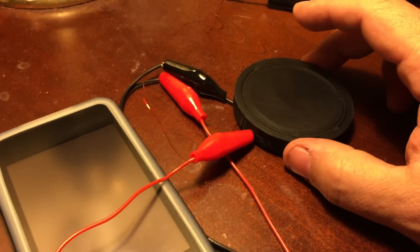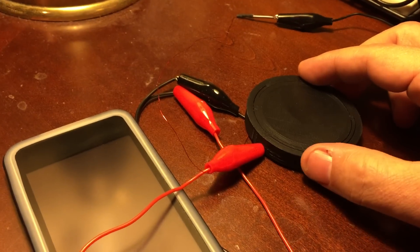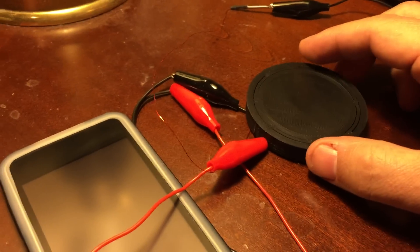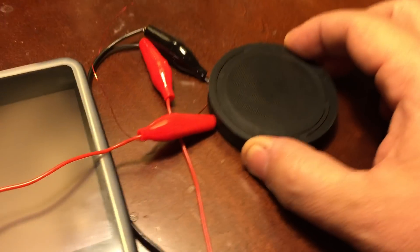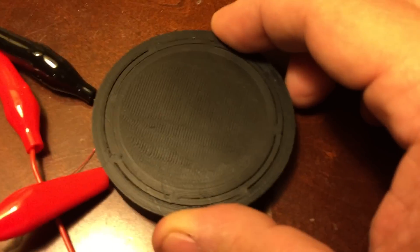The magnet wire I just got from Radio Shack. I took the thickness of the wire and calculated out what the resistance would be for either 4 or 8 ohms. It's been a couple months since I've done that. I know ohms resistance is not the same as impedance, especially with a speaker, but it got me close and it's actually working pretty well.